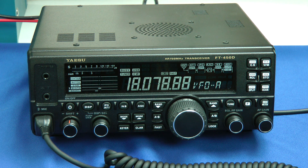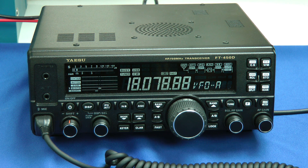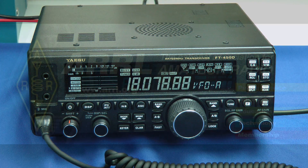I did notice some improvements in third-order IMD dynamic range, and I believe that's because this radio has a 10 kilohertz roofing filter at the first IF. I saw an improvement at the two kilohertz spacing of approximately 9 dB — that's significant. Also, the 5 kilohertz spacing of third-order IMD improved from 75 to 86 dB, and the 20 kilohertz spacing with the preamp off was 97 dB.